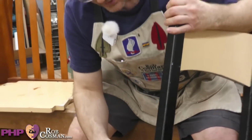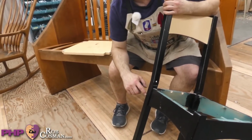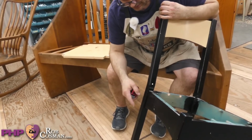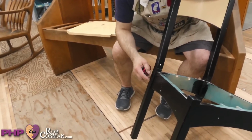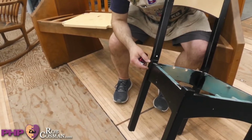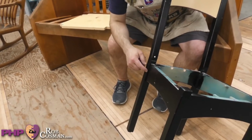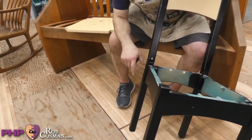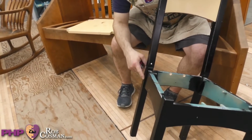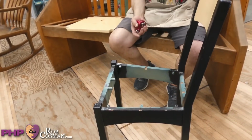And the other reason is that not only is it a 1/2 inch wide and that long, but it's also going way back here. So that would really weaken this piece. So instead of doing that, I made the tenons a little shorter, which allowed me, I think I had a 3/4 inch piece that remained intact. So I had a mortise on this side, then solid for 3/4, and then a mortise on that side. And just having that extra piece in there stiffens up that whole section of the leg. And as you guessed, this is the high stress part of the joint. A lot of technical stuff when you're building chairs, if you want them to last.